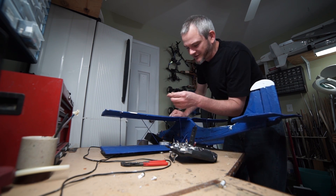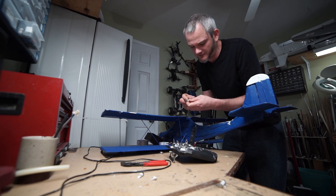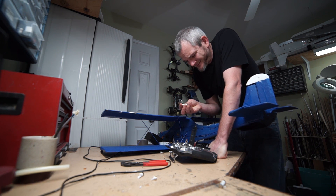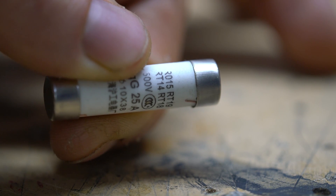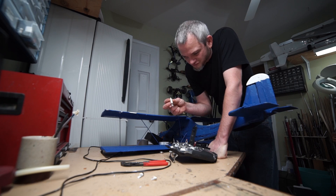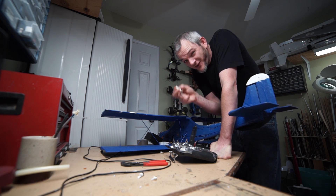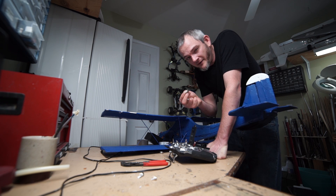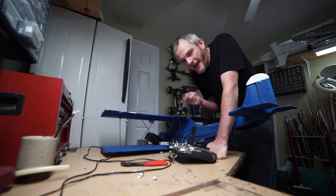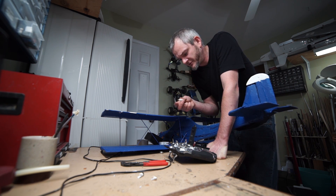Probably the only thing authentic on these is the ceramic tube. Even the caps aren't the correct size — they're supposed to be a little bit deeper, so even those are probably counterfeit. The way they constructed these is completely scary. They literally just crimped the wire. You can clearly see the wire hanging out the end on most of them. They probably just had a machine that drew a piece of copper wire and went ka-chink in a press. This is scary because many people would buy these thinking they're buying the correct thing, put them in their equipment, and what happens when a house or business burns down? These are usually for industrial applications — that's what's scary.